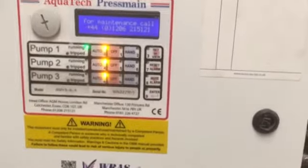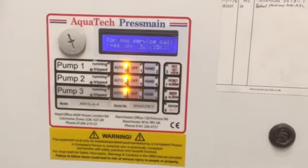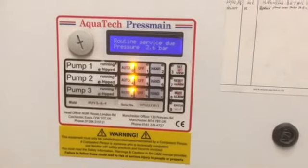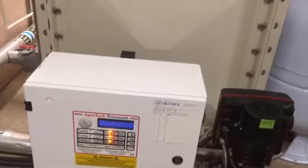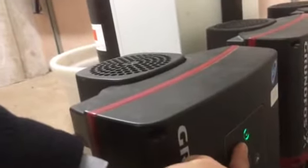You're then restarting and it starts the process again. As soon as it can see a bar or couple of bar pressure coming back from the piping, it will start to kick in properly. You only know you're back in a correct position when the pumps start to cycle — you can see how they're coming on and off. You basically want to get to a state where they're all showing auto, there are no faults showing, and it's not locking out.